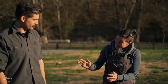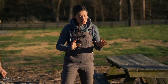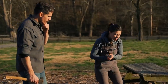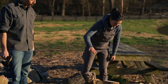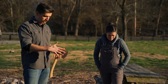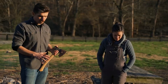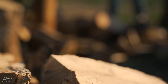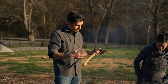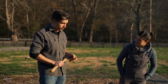Josh is well known for being very good at carving and also being very resourceful. We're going to pick through this stack of wood to find something to make our hat rack. We have a beautiful selection of poplar, sassafras, and oak. I'm thinking we need something maybe six inches wide at least. We'll split out the board, pick anything from this pile, and make the dowels that we'll drill a hole for at an angle — that'll be our hat rack. Super simple, just a board and some pegs, and you can do that really with just an axe and a knife.